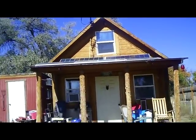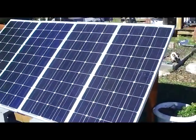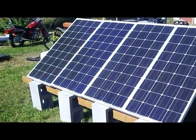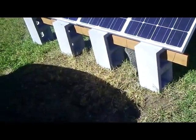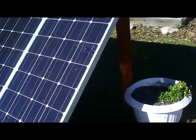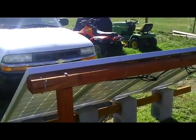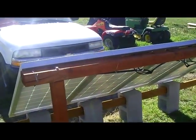Before I did that I went ahead and hooked up my new system, which is four 100-watt Renogy solar panels — monocrystalline panels at about a dollar a watt with free shipping. I made my own mount using cinder blocks with a treated 2x4 through them, wired the bottom of the panels to the 2x4, added rebar along the blocks to hold them down, and used an old horse hitch post on each side with high-tensile electric fence wire to attach the tops. It's a solid mount — they're not going anywhere.